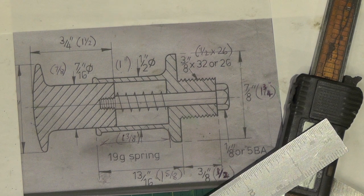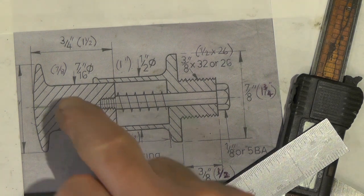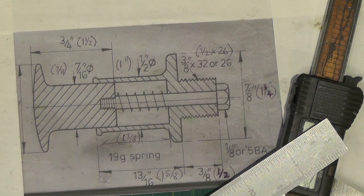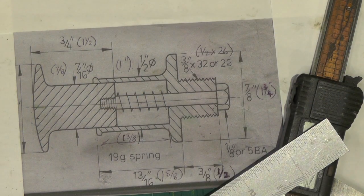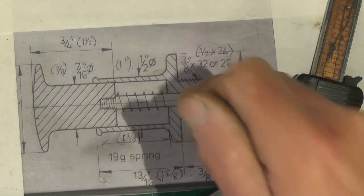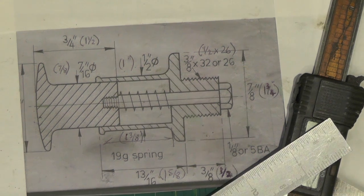Okay, I'm on the next part of my buffers — I think it's part 3. In parts one and two you'll have seen where I made the actual buffers to that drawing. I made the sliding part out of stainless and I made the rear housing part out of mild steel. I'm just painting the housing part now, and when that paint's dried I'm going to move over to the loco, get it off the rolling road, and get the buffer plates drilled to accept these buffers.